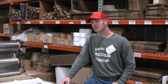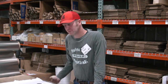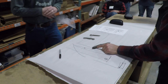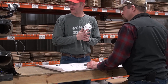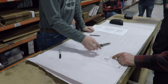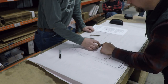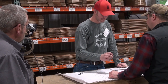Can you guys touch on the height of the lock bar? You know, where you cut your slit, how thick should this be? An eighth? I mean 3/16 of an inch probably. Okay, so 3/16 here at the face, because you're only catching down at the top. Yep. So 3/16 is really what you're looking for here. You're a little better, what, quarter? Yeah, probably a quarter there, but probably 3/16 in that thickness right there. But you're talking 156 thou right there.